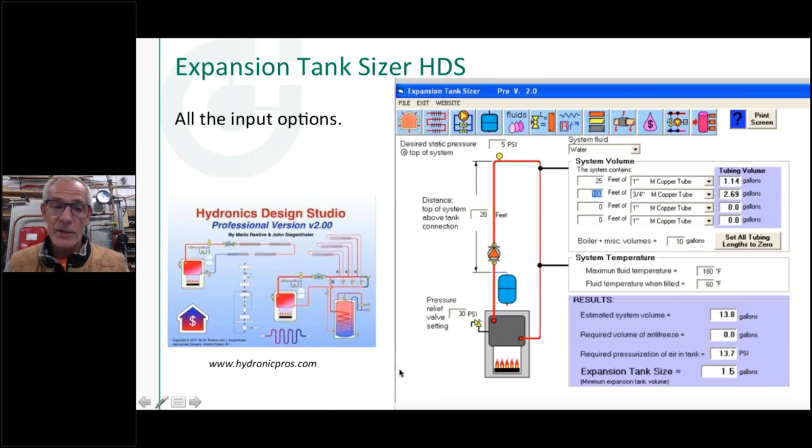So if you want to play what-if scenarios, we did, by the way, if you want to go back to some of the past coffee webinars, Jody Samuels worked for us for a while, and he used to work for Amtrol, and he did a really good job explaining expansion tanks with the long-hand sizing. There are actually tables that you can use, and you can cross over. It took him about 4 pages to get through all the tables and the pressure and temperature relationship to size an expansion tank exactly. But again, you can see with these little simulators, why wouldn't you just plug in some numbers, click calculate and get an answer? But if you want to know, and by the way, all that information is also in this engineering guidebook from Amtrol. It's got all the math behind how you build these calculators, basically.